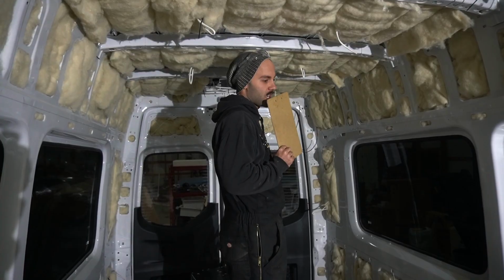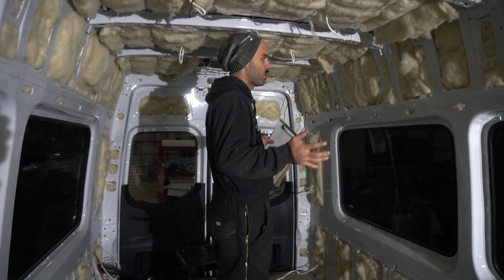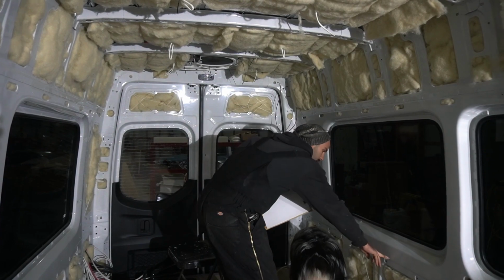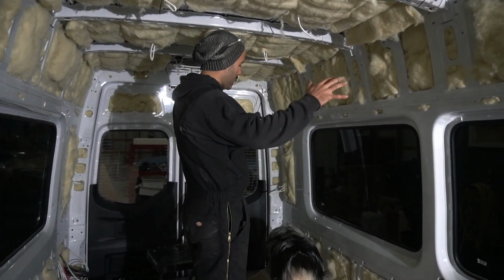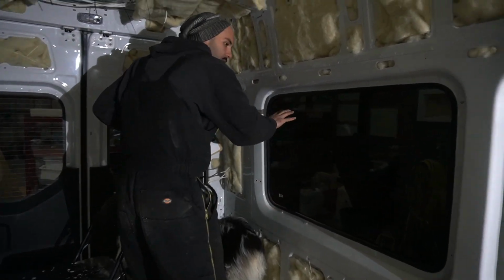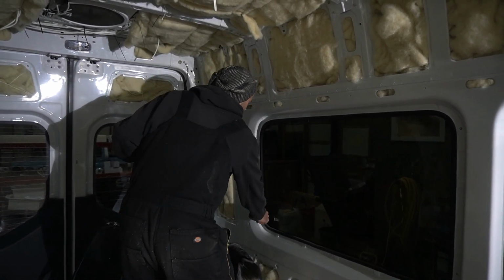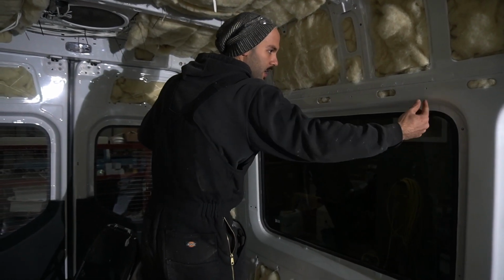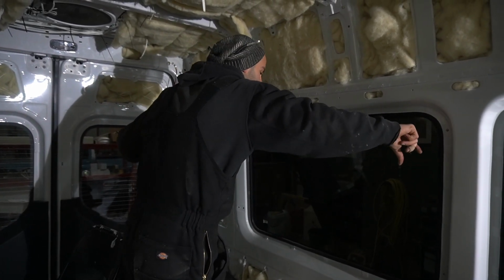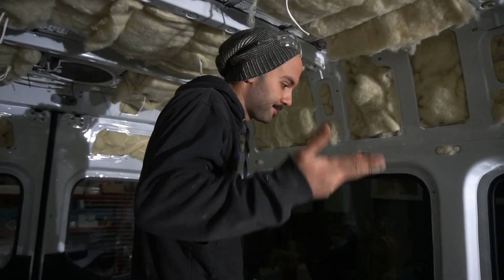Oh, man. What I'm thinking, got the clipboard, so that means business now. I'm thinking my idea, since we're using 1/4-inch paneling just for lightweight purposes, because from here to here is 4 foot, so I think I'll turn the sheet of plywood this way, long ways. I will cut inside this window. I'll make a square, and so that I can build a frame, I will glue either 1/2 inch or 3/4 inch furring strips inside of it. That way when I come with my frame, I can nail my frame to something thick and meaty to secure my frame. I think that's best. Still working on this.